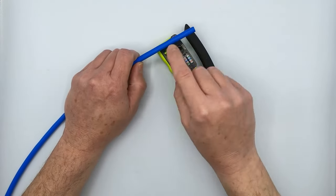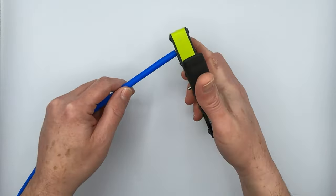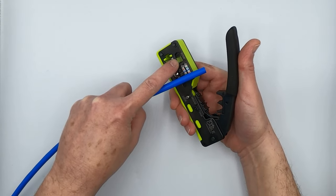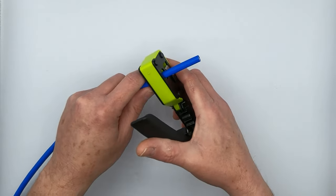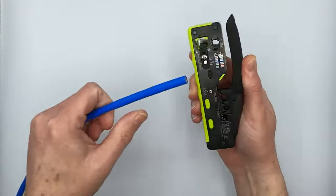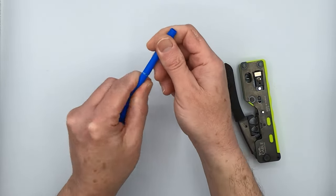We're going to terminate one of our cables here. This is Category 6A riser shielded, and it's one of our thicker cables. We're going to unlock our tool and strip off the cable jacket. This stripper works pretty well — it handles 6mm to 8mm cable jacket outer diameters and puts a good score on there. I usually put about 2.5 inches through there, then close the tool all the way and turn it around one time. That's all you need to do. Lock your tool up and when you start pulling your cable apart, you can see it's got a good score on it.